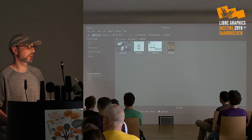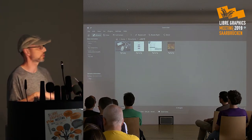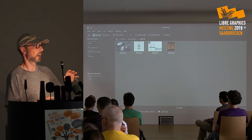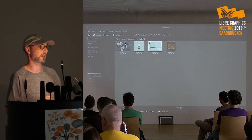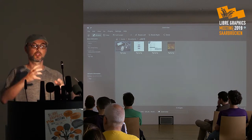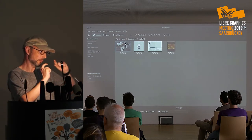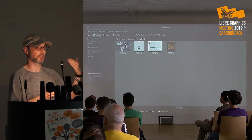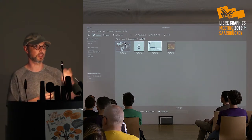The problem with importing photos is at least partly solved. None of my solutions are perfect — there are still some weak spots. In Little Backup Box, for example, there's no easy mechanism to teach the device to recognize which storage device is which. You have to go through a specific sequence: the first device you insert is considered the backup device, and the second one is considered the source.